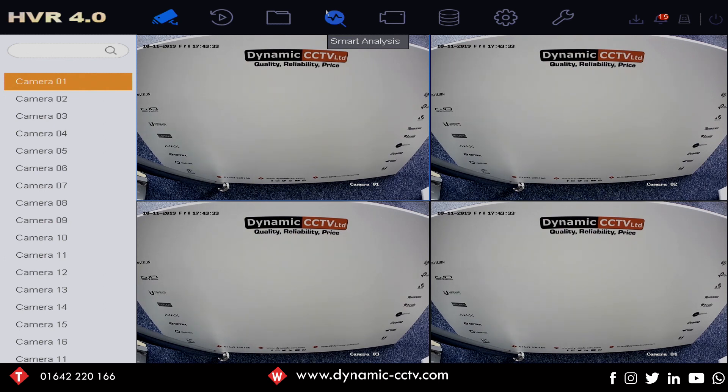As you may or may not know, the TVI range of DVRs can accept one or more IP cameras out of the box. The enhanced IP mode basically gives you scope to add additional IP cameras above the normal quota, and in some cases more than double the amount can be accessible with enhanced IP mode enabled.